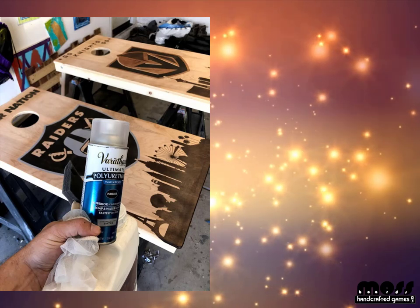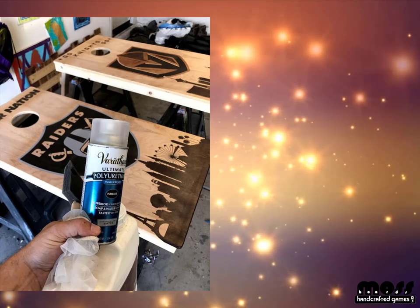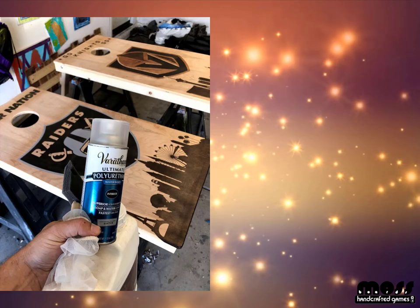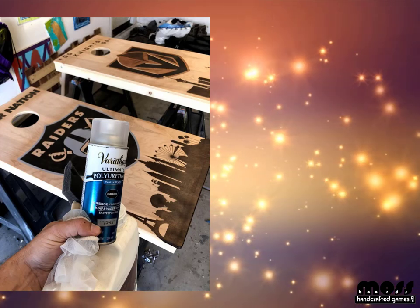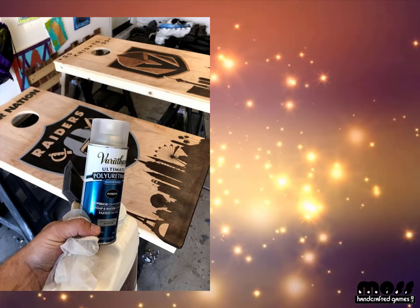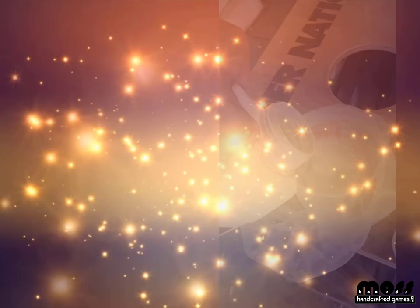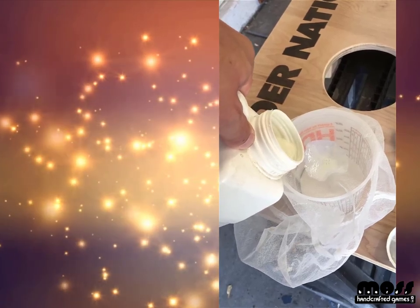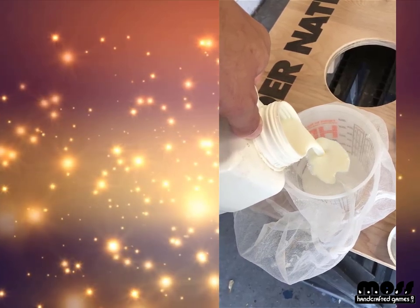The aerosol spray is a great way to lock in your designs. If you have stained or painted your designs, it's good to start with that aerosol spray — especially if you don't have a lot of time to wait for them to fully cure. This way the liquid clear coat is not going to smear your stain or paint. After you've sprayed and let it dry a bit, you can filter your polyurethane. I always run it through a hairnet-style strainer.